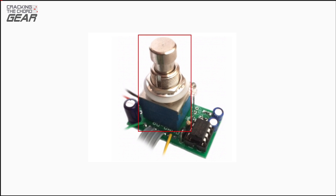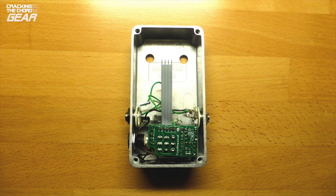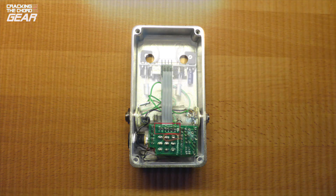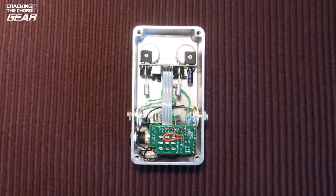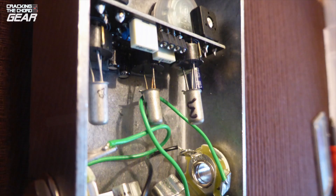Then came the push button switch, which is really easy — you just have to make sure that you keep it flat to the main board, tack it in place at two corners and then solder the rest of the connections. I then soldered in the leads connecting the board to the power socket and the in and out sockets. It required a magnifying glass to identify which pads to connect which leads to. The fact that you're dealing with positive earth transistors induces a degree of fear, but you've just got to be patient and work through it all logically. Unfortunately soldering in the LED and jumper would have been a lot easier before I assembled the entire board. The LED was relatively easy, but after struggling to solder in the jumper, out of frustration I eventually soldered it from the bottom — not a very elegant solution but it works. The upside is that I got to pick a blue LED while the standard LED normally supplied is white. The last thing was to insert the germanium transistors, marked one through three, into the sockets.